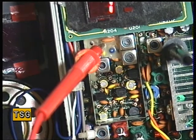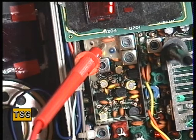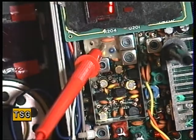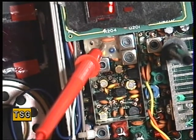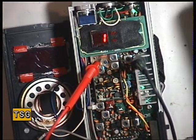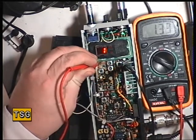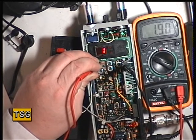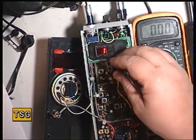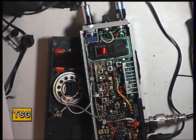What I've done while you weren't looking is swap the radio. The one I was working on has no transmit — there's something wrong with the transmitter, no doubt because of its duff aerial. So I've looked at the less corroded one of the two corroded ones and decided it's in better condition and actually kind of works. We're going to go for that one instead. I'll probably swap the back off the non-corroded one onto this one. So we're still at the same point. On test point 3 I've now got 1.8 to 1.9 volts for the VCO — the same on transmit — and we're adjusting with transformer T5.